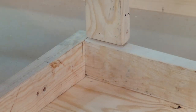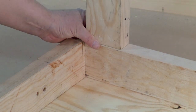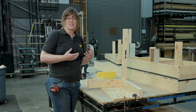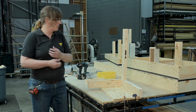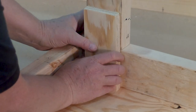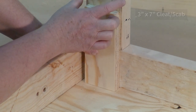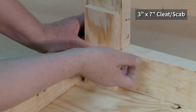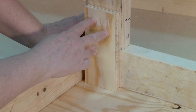This technique is a bit of an odd one, but it puts the leg on the frame and requires a 2x4 frame with a 2x4 leg. I don't know if this would work with a 1x6 frame and a 1x6 or 1x4 leg — I think it's just a little too flimsy. This kind of works with 2x4 or stronger material. We take these cleats and attach the cleat, which is slightly narrower than the 2x4. This is 3.5 inches; I've ripped this to 3 inches, and it's twice the distance — so 3.5 plus 3.5 gives us 7. So it's 3 by 7, and I have to put 5 screws here and 5 screws there.